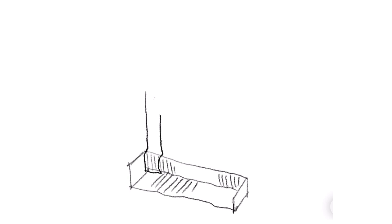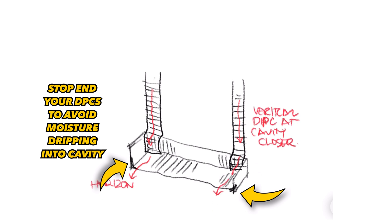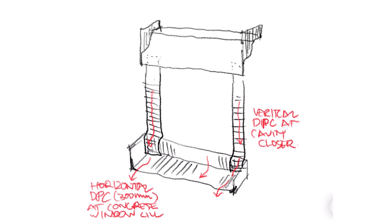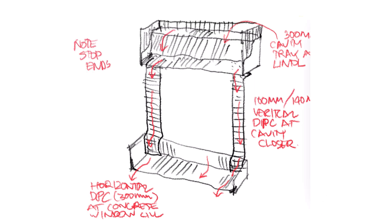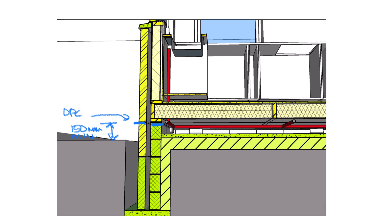Tip three — DPCs around windows and openings: always create stop ends along the horizontal damp course where it meets the vertical damp course, so moisture running down vertically is collected by the stop end and directed to the outside face. One of the most common mistakes in masonry is not properly lapping the DPC as the opening is constructed — always inspect these stages before they get covered up. Tip four: if your DPC isn't 150mm above the ground floor with weep holes above it to allow trapped water to escape — whether you have a solid concrete floor or a suspended floor — start to worry. The DPC needs to be bedded in before the next brick course or sole plate is added.